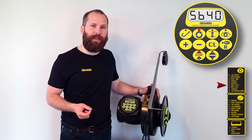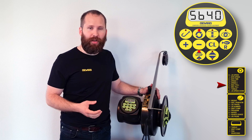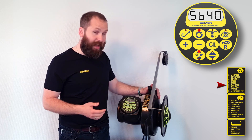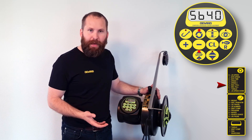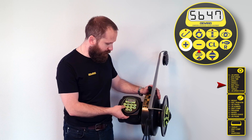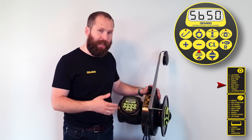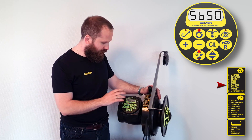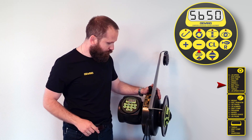Standard is set at 40% and that will be good for most fishermen and most types of fisheries. But in some cases you may want to increase that value — for example if you're targeting big coal fish in deeper waters, or a mackerel fishing setup where you have lots of different pulleys and friction on the line and a heavy sinker. So 40% might be a bit too little in that context. We're going to increase it by about 10%, but be conservative in the beginning. Use five to ten percent at a time, then save it. We've set 50% of maximum torque, maximum pulling power — saving the value by pressing this once.